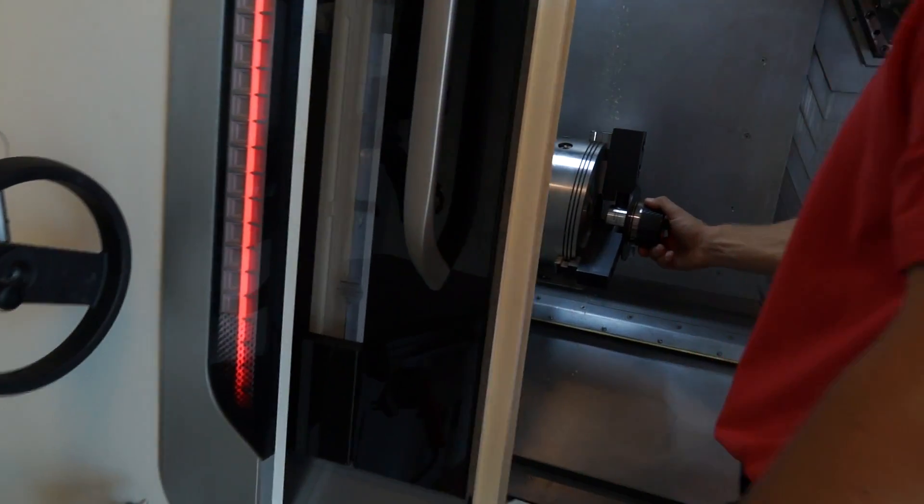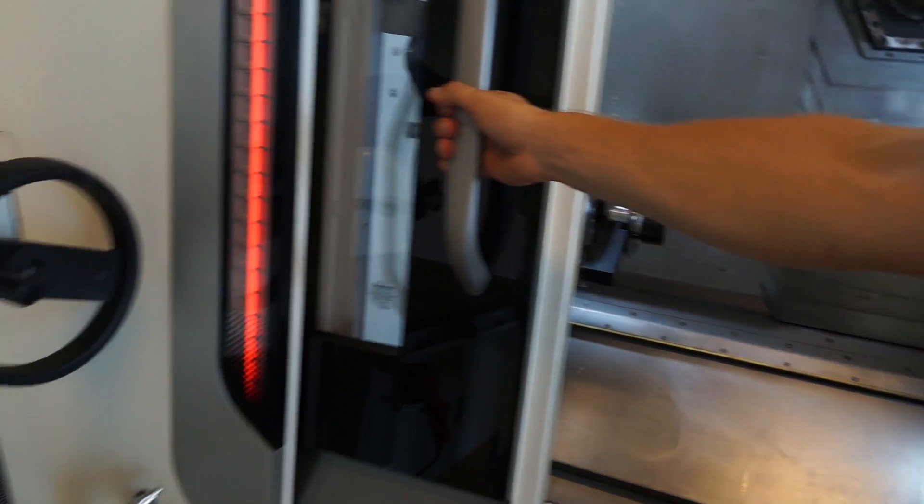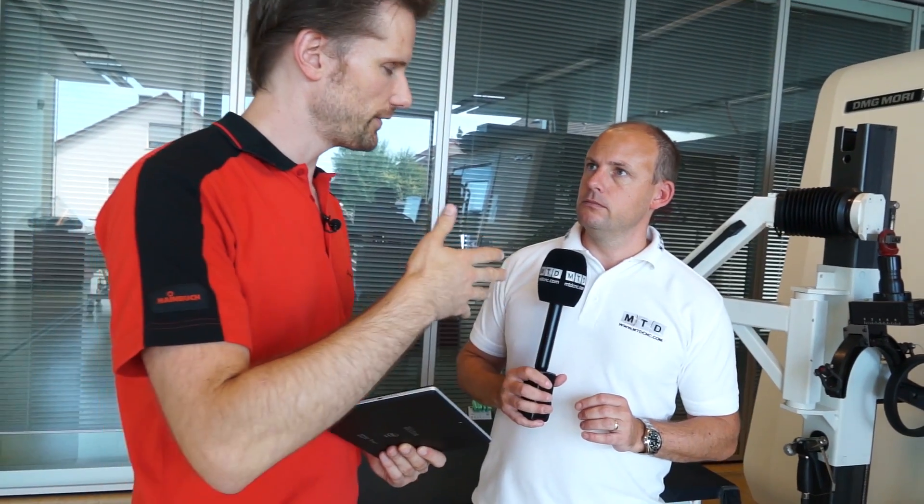Clemens, am I right — is that really what the tester kit is for? Yes, it measures the radial clamping force and we are now doing this to see the difference between the static clamping force and the clamping force with a rotating spindle.